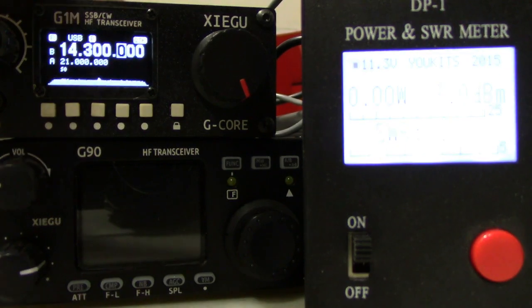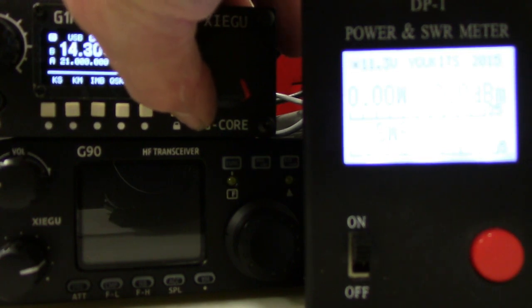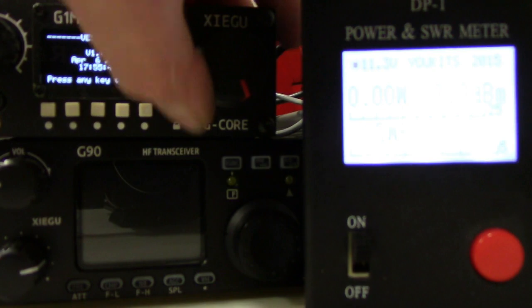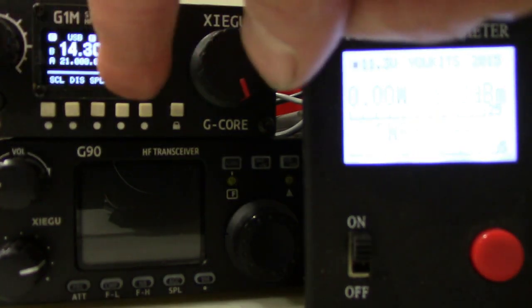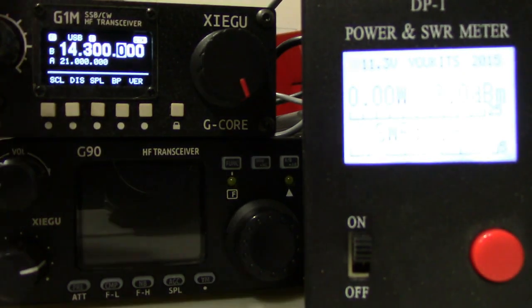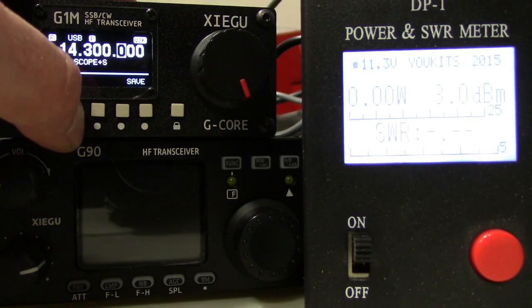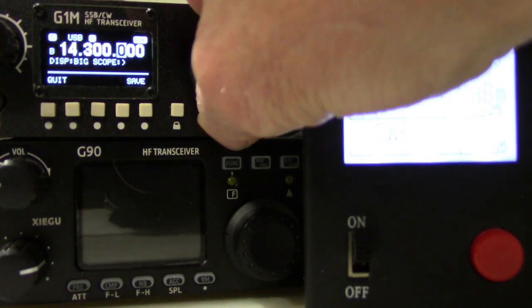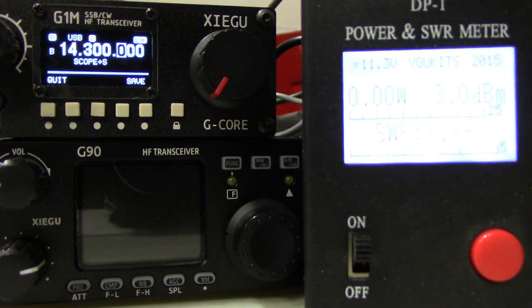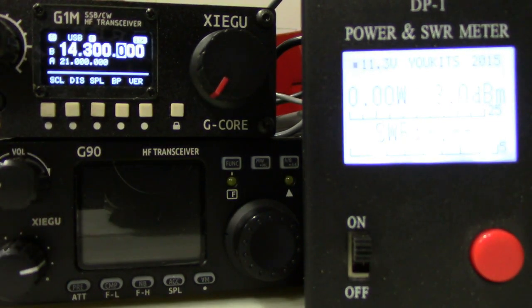You can see the call sign come up, and then the band scope comes up. To go through your menus, you just push this button here and it takes you through the rest of the options. We can see that this is version 1.05, which was from April 6th, 2019. Press any key to exit and you can go through each of these — they all have a feature on them. The last screen that you're on will remain in place. On the display, I have an option of the scope plus an S meter, just a scope, a big scope, and of course back to scope and S meter. Once you have chosen, you hit save, or if you just want to quit to get out of it, you can.